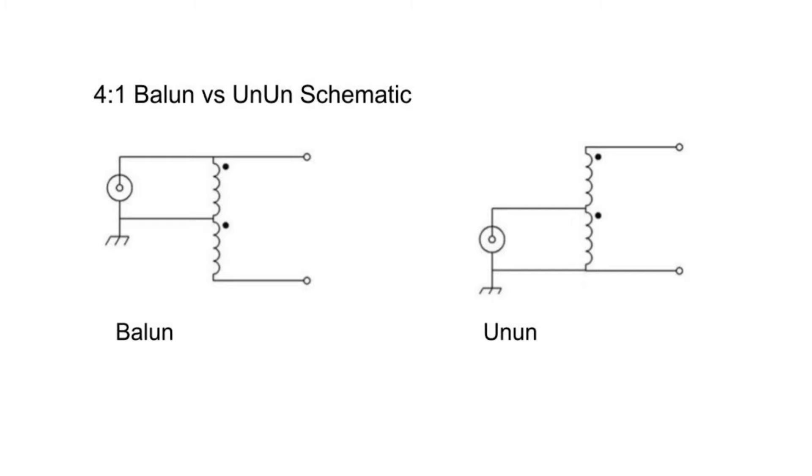I'm not 100% sure if that is your use case or what you're going to do, but I'd start there. If I had problems, then maybe I would try making my own 4 to 1 balun and putting it on there. But I would immediately put a 1 to 1 choke behind it and see how that performs for you. Good luck with the antenna.